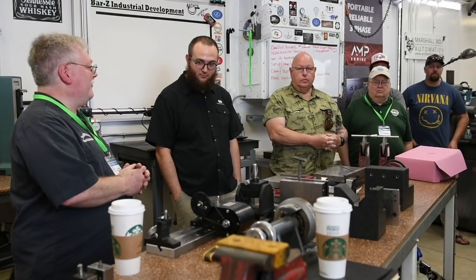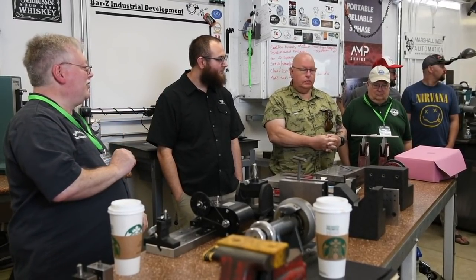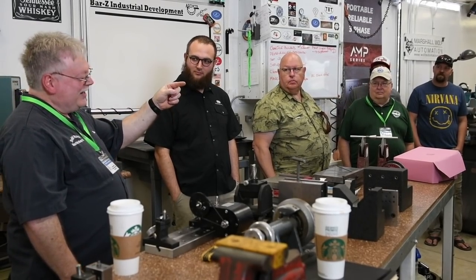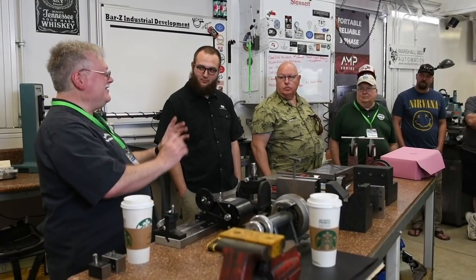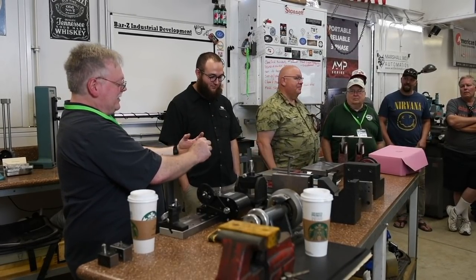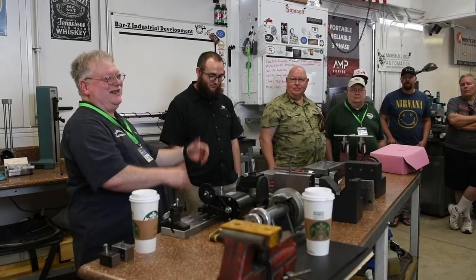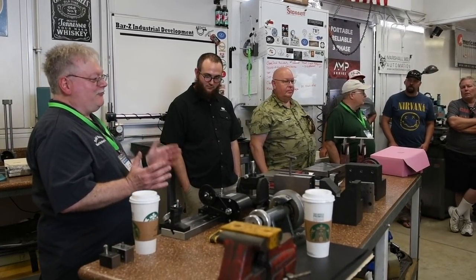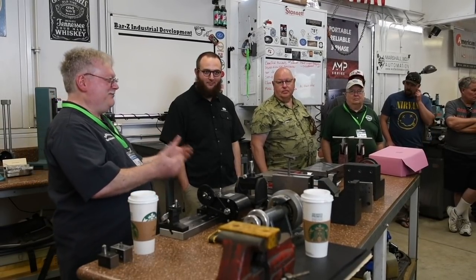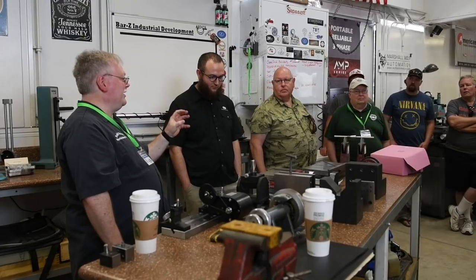There are different balancing methods - YouTube has many videos. Your 8-inch wheels and under, even wheel manufacturers debate whether you even need to balance them. If you're going for the ultimate finish, balance the wheel. If you're satisfied and you know you're going to be changing wheels constantly, it's just not economical in a job shop. The hubs are about $100 a piece for a good one. If you want 10-15 wheels dressed on their hubs, you've got a lot of expense on the wall. Also, as an aluminum oxide wheel wears from 8-inch down to 7-inch, you have to take it off and rebalance because the density isn't even all the way across.